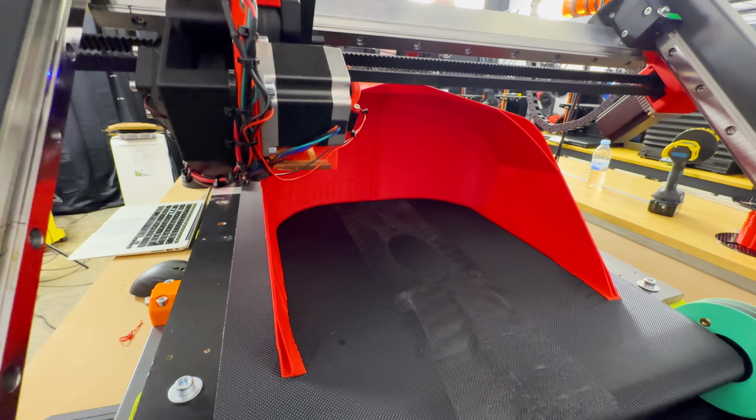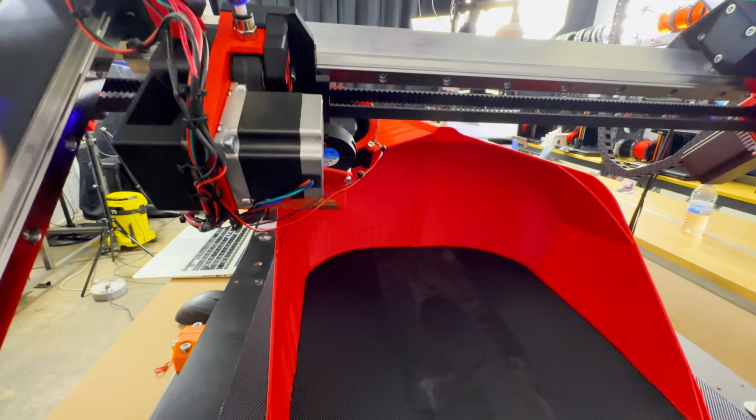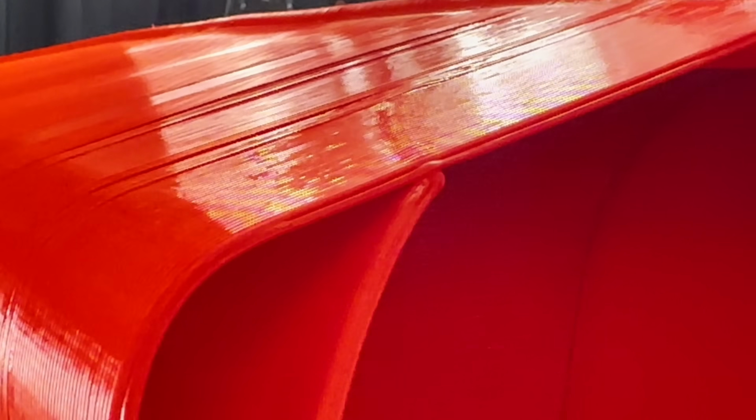As it's being printed in vase mode, the features like the seat aren't connected, but I made sure that the gap between them was small enough so they actually get connected when printing. Hopefully that will add to the overall strength.